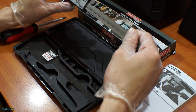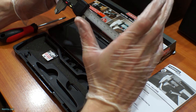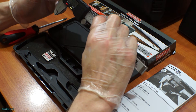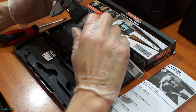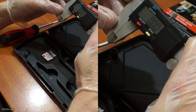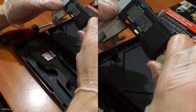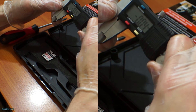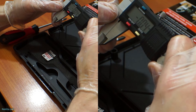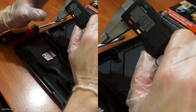The sticker isn't properly attached, but that's not the main issue I'm having with this unit. I buy a lot of stuff from Lidl and normally the stuff is very nice, but this unit is not. As you can see, I'm reading out 0.00mm with it completely closed. Now let's force it beyond — well, below minus I guess — and it's reading out minus 0.04mm. And that's not correct.